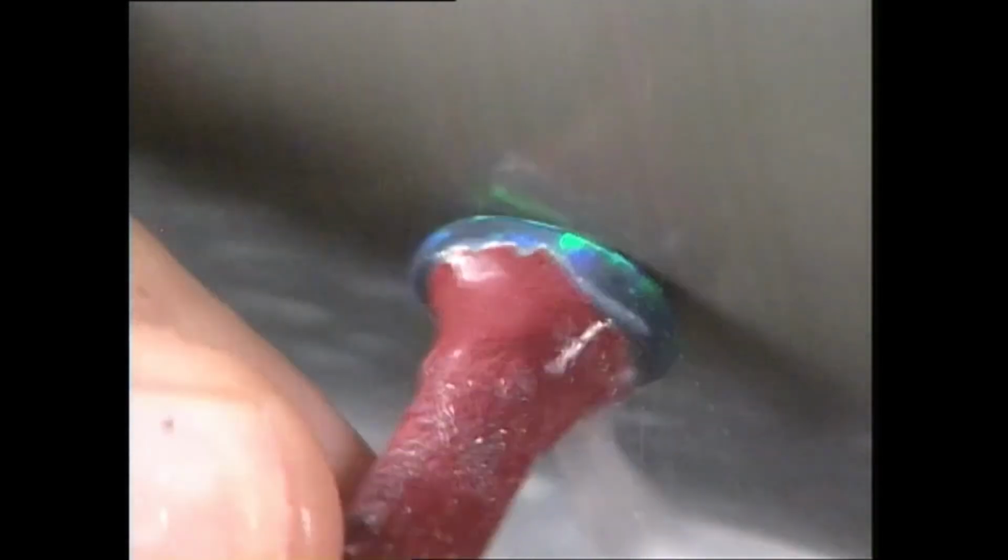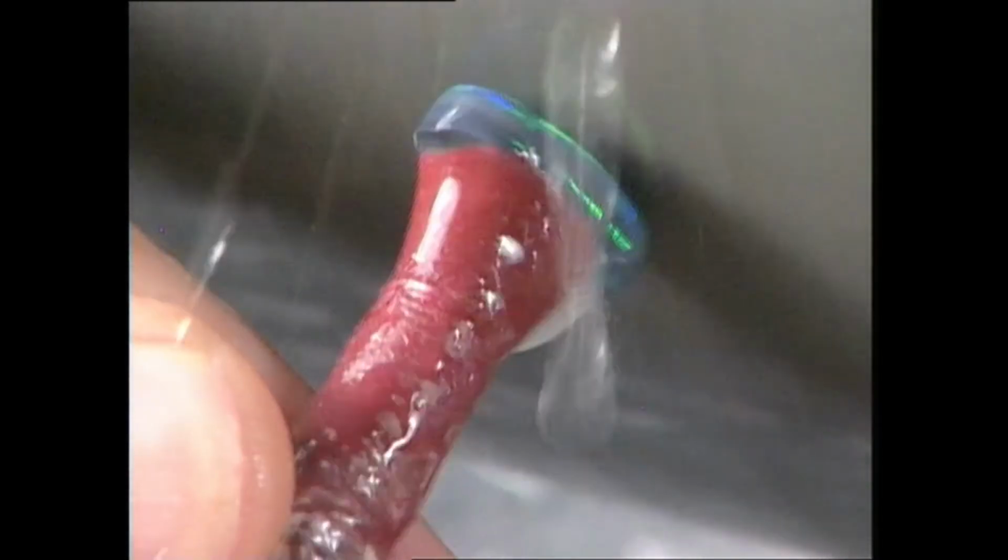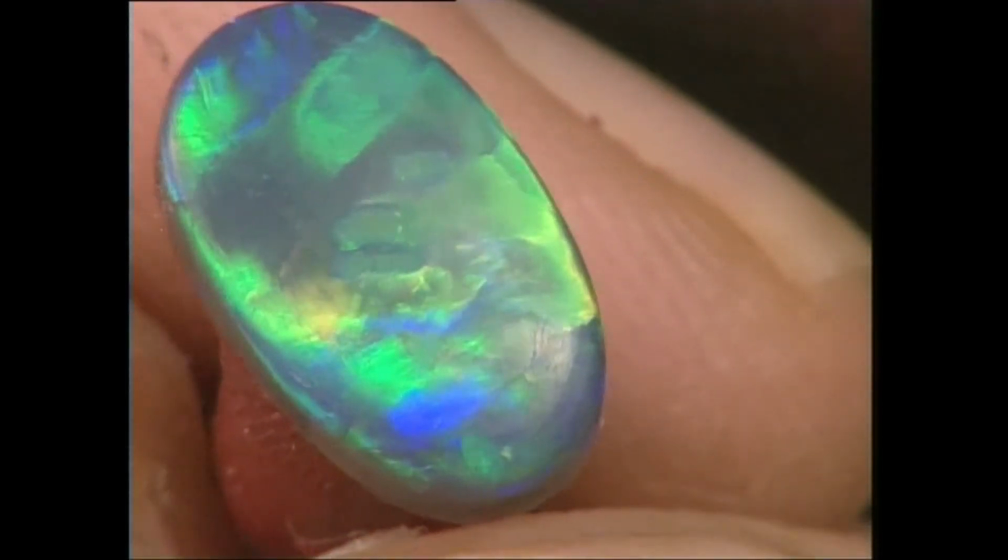Spinning it from the edge to the centre. Cross hatching again. We'll show you here in slow motion, working the long sides first, up and down, backwards and forwards. The cross hatching is actually a circular motion working across the face of the dome, but we're working across the long axis. It's just to get rid of the spiralling, and evenness has to be created.